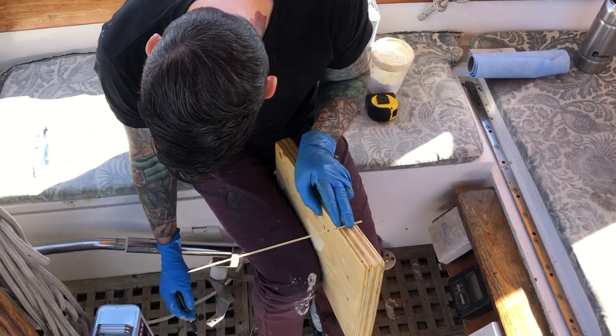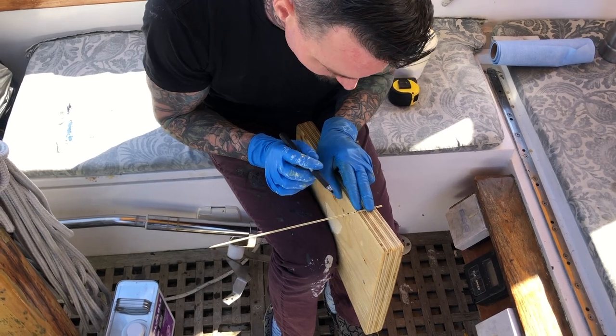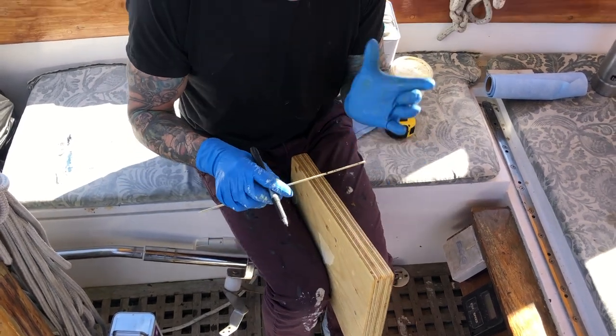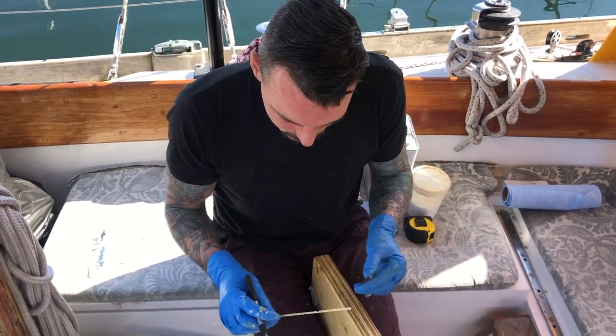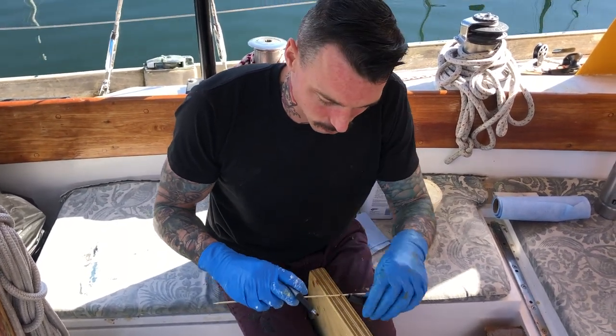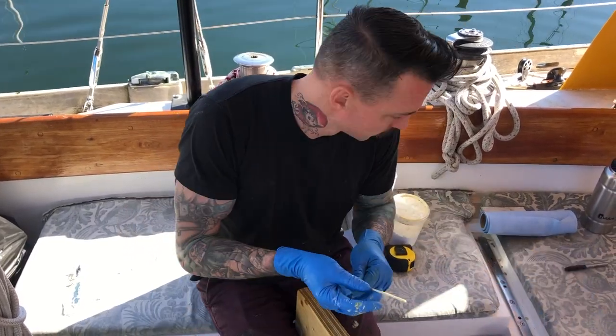And then the plate here is about 1/8 of an inch. I added 1/8 and then a safety margin. And that gave us 2.5 inches. That's the length of bolts I need. Because it's always hard to eyeball that stuff. So I just use that little trick. It always worked so far, so hopefully it works this time.